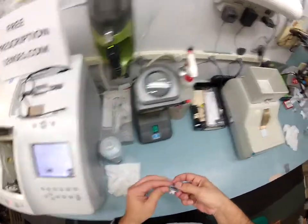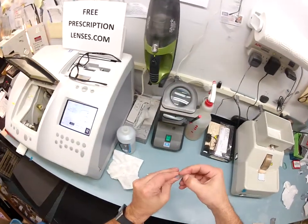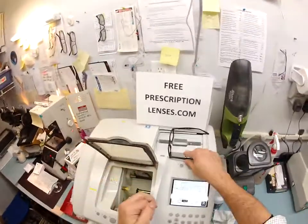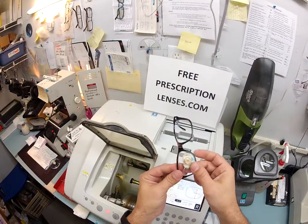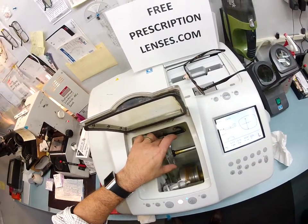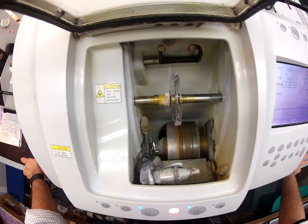I'm going to dry your lens off one more time, go back to the hand stone to put the safety bevel, and use my thumbnail to scrape everything off — onto the counter, and this time with a behind-the-back technique. I'm going to check to see if it fits: tuck the lens in at the outside corner with the frame upright, then press down at the nose with my thumbs. It snaps in perfectly. I'll flip this over and cut the left lens — I hit the start button and it comes down to trace the shape of your frame onto the lens.